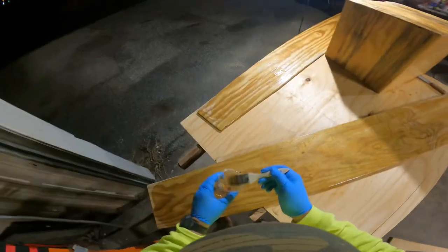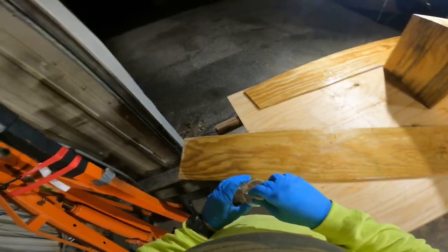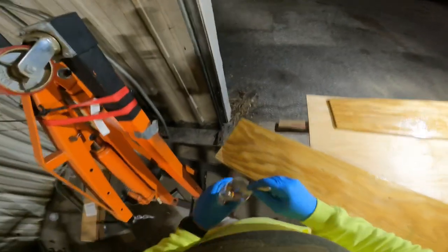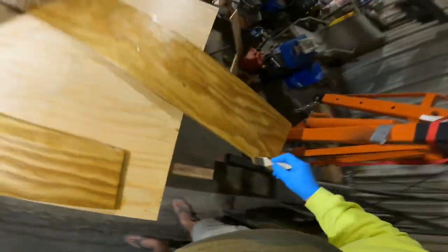All these little voids don't do you any good, so they're gonna have to be filled. Another trade-off is you spend more time laboring with this kind of plywood to fill voids, cracks, and crevices. It just depends on what's more important to you — your time or your money. My money's more important at this point; I've got plenty of time.